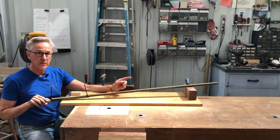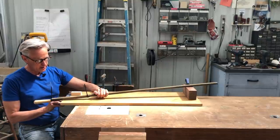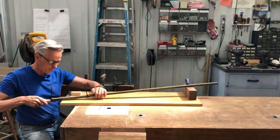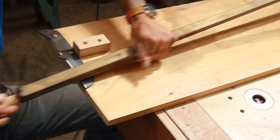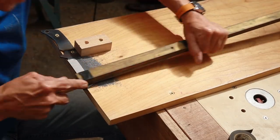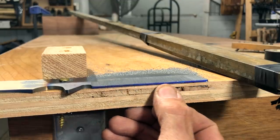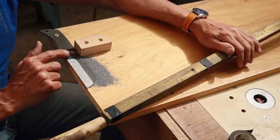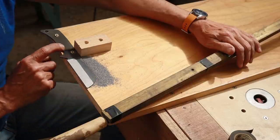And in that case, what I can do is simply lower that block of wood that I have at the other end. So I'll file this down until I get to that center line, and if my bevel hasn't come up far enough, then I'll lower that down. So it looks like I'm down to that line now. Turns out I'm really pretty happy with the bevel that I had chosen. I like the proportions of the bevel to the straight part.